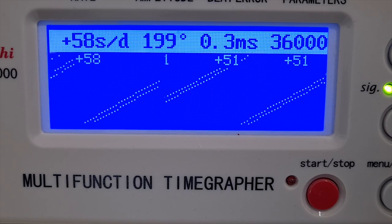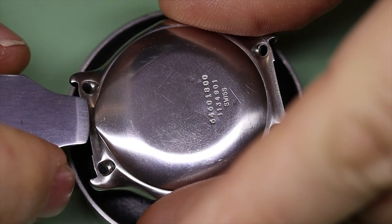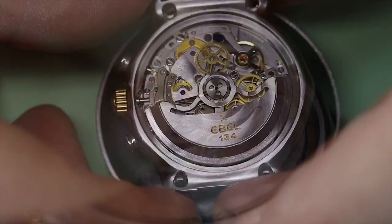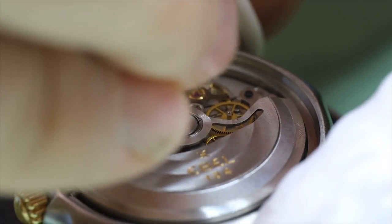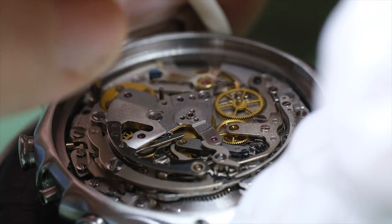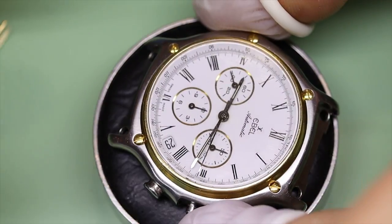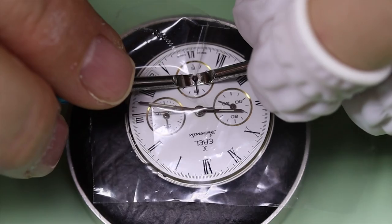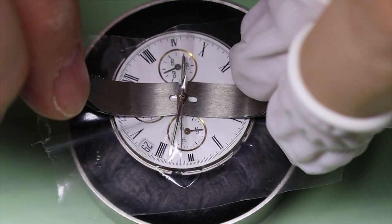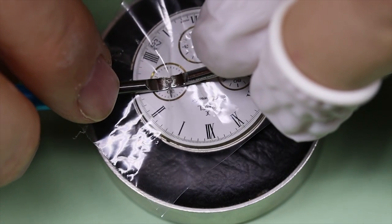The timegrapher shows straight lines, which probably means the watch is okay mechanically and just needs a service and cleaning. It's a crime to have such a beautiful movement and not be able to show it. The El Primero is like saying 'the Ford' - it's an entire family of movements. This one is more or less the base model, the 400, but the family also includes moon phase, open heart, and the D5 version with a silicon escapement.